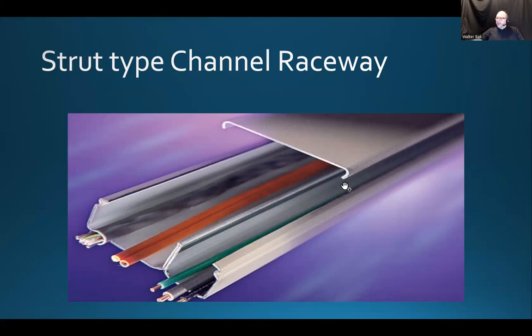What does it look like inside? A lot of them are using dividers, and those strut types of raceways would have a division for the data section, and over here you can see some sort of a multi-pair cable, maybe for some intercom or whatnot. You can run data wires and or any kind of signal wires, and over here you could see an optical fiber. Usually optical fiber I would prefer to run in a separate raceway, so there is no possibility of anything else coming down on it and accidentally damaging it, but maybe somebody decided to include that in with some other cabling as well.